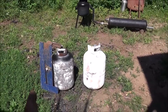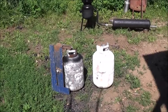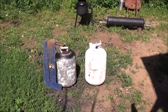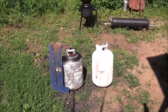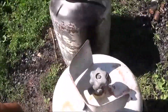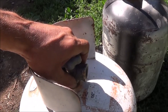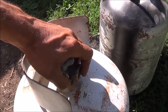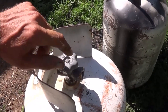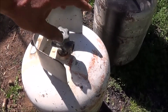First of all, I buy these propane tanks from a yard that's already pre-emptied all the tanks. Even the little bleed-off valves are removed out of them. They've been sitting out in the yard for quite a long time before I purchased them empty and open. Even then, they're not safe to directly cut into. So what I do is I fill them all the way full of water right into the opening of the valve here. I just stick a tube down into the opening and because the bleed-off valve that usually goes right where the tip of my thumb is is out of there, you can just pump water in and when it gets to the top, the water will come out your bleed-off valve, letting you know it's full. I keep water in that the entire time I'm cutting into it until I've removed the larger section.